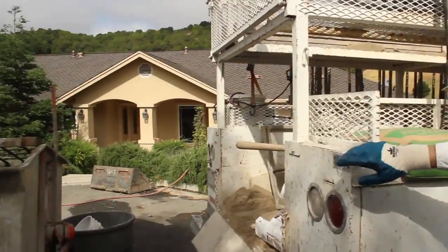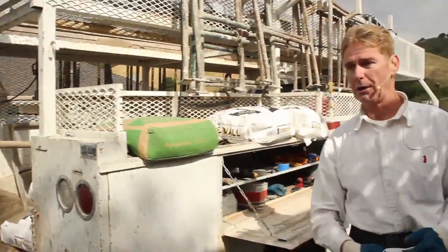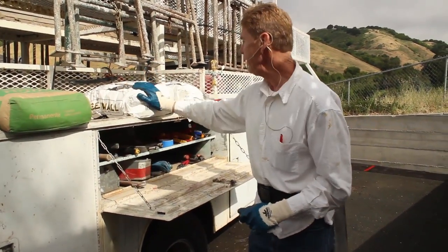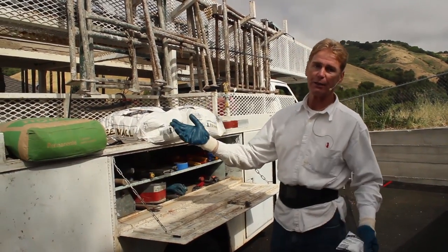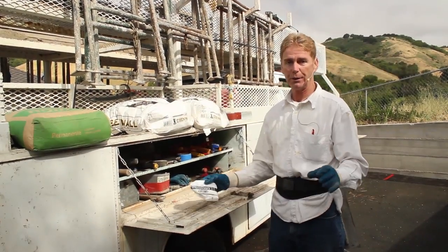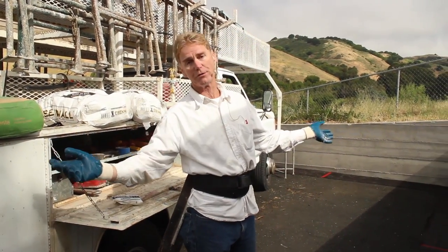Now, look at the house. It's a tan. The color of the cement, as I said a little while ago, is dictated by the sand. So if these bags right here of Eisenwall are white and the sand is brown, that's going to make a tan finish. Why are we going to do that? Because a tan finish on this wall will be maintenance-free for hundreds of years.